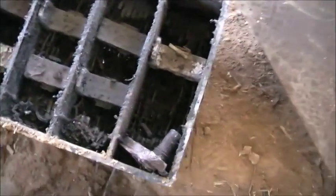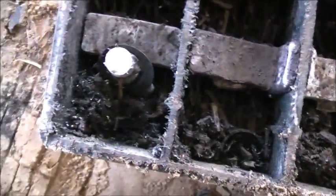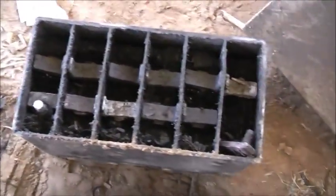Finally got around to cutting this battery in two. It's time to get the cells out. They are buggered. The positive plates are a bit swelled up and warped. The negative plates are non-existent. That's one shagged up battery. Anyway, it's time to gut it and clean it all out, ready for the capacitors to go in there. Been a long-term project, that one.